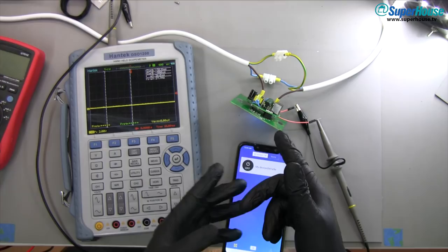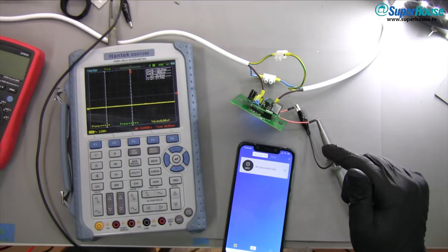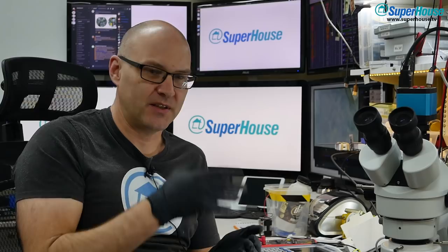So the result is that it's faking it. It looks like we're getting continuous power out, but it's actually turning it off very briefly — just enough to get the power it needs to run its own electronics. When the output is turned back off, it doesn't need to keep flipping the TRIAC, so the output is open circuit, it's got full potential across those terminals minus whatever drop there is in the load, and it just runs the power supply as normal. You can see a power supply that runs in two different modes: when the output is off, it has the full potential across the terminals; when the output is on, the relay is closed and the TRIAC is on, so it coasts on the charge built up in the output capacitor, then periodically turns off the output to generate the potential it needs, builds the charge back up, and keeps going.